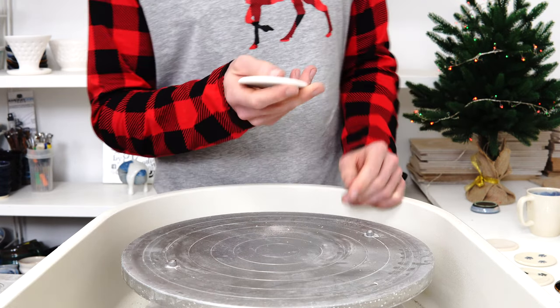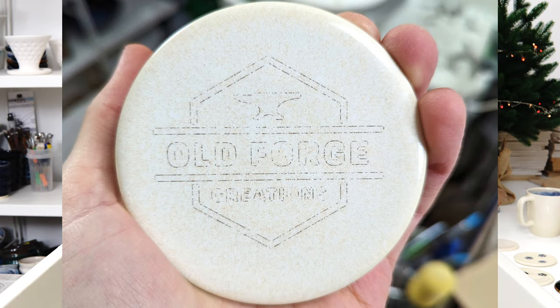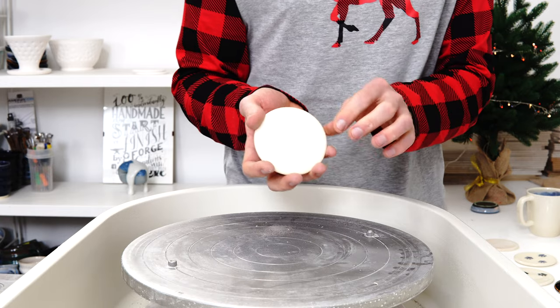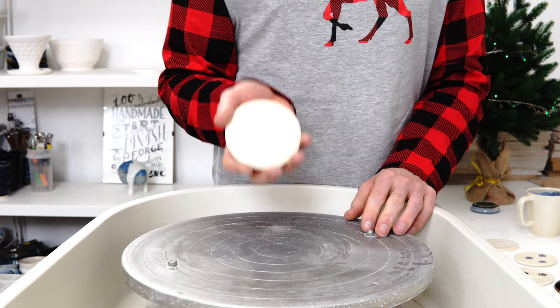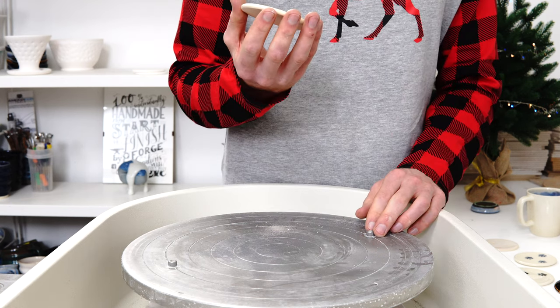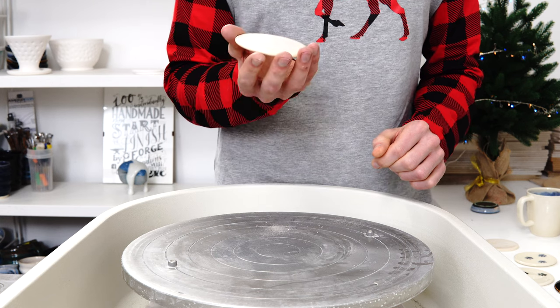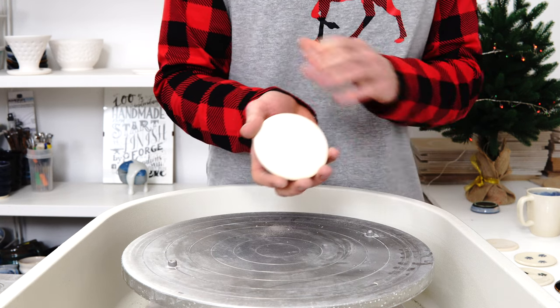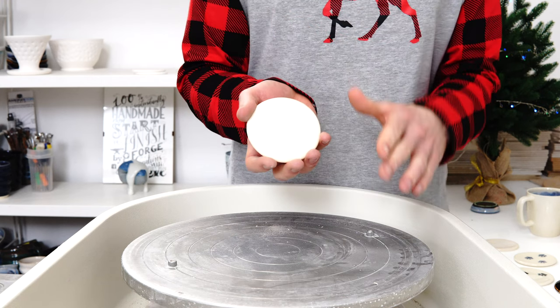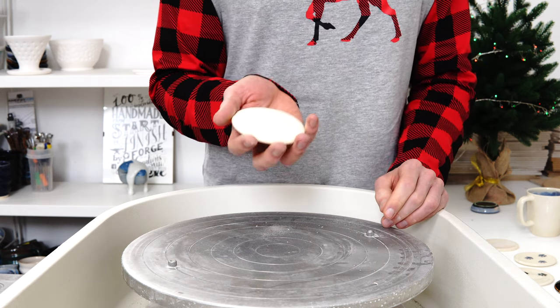I tried lasering directly into the glaze - it's marked it, but across a few different glazes some won't pick it up at all, some like this one are quite patchy, and others mark perfectly cleanly. I assume that's something to do with how the glaze absorbs the laser. It needs to receive all that energy and absorb it in order to mark, and some glazes resist that more. You can brush over a medium or stick on a sheet that will absorb the energy and transfer a mark through.